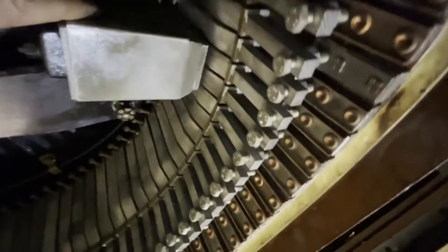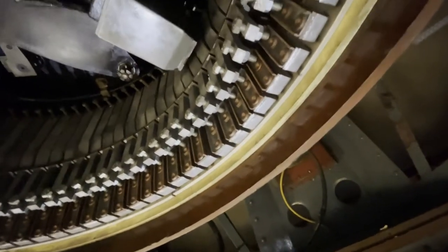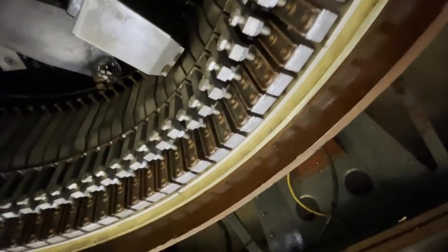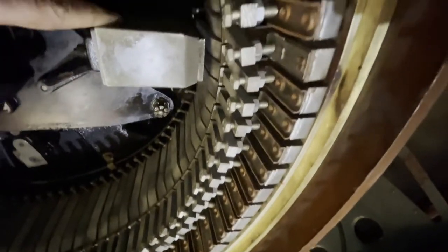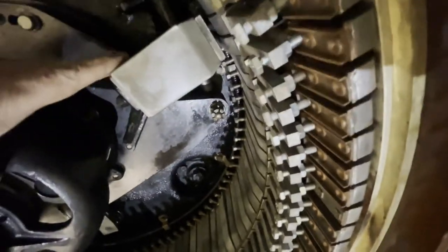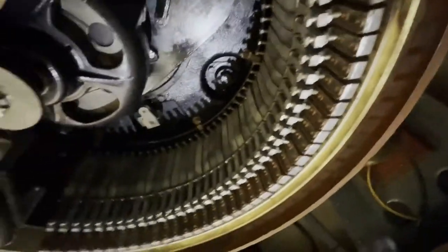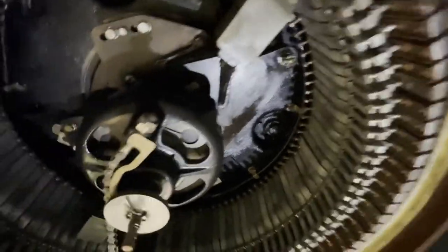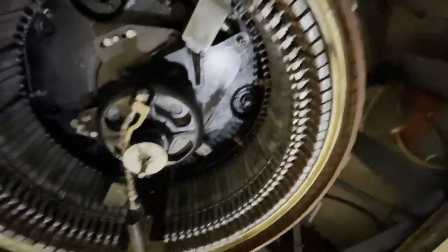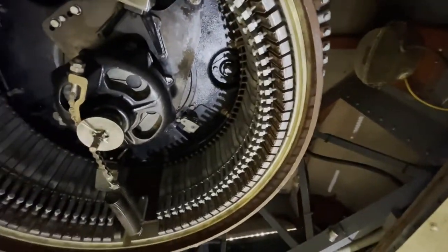When they're pulled at the top, they press the bottom. So there are always two, three, or four contacts engaged at a time. Changing the taps on the variable resistors — whereas a normal traditional tram control has got six or seven different settings for power, this has about 40. So it's a genius system with much, much smoother control and less jerky acceleration.